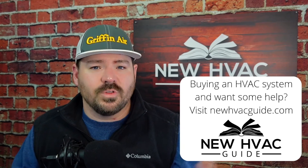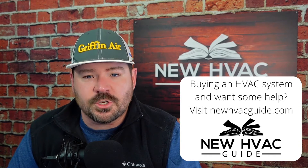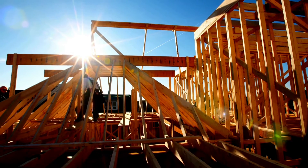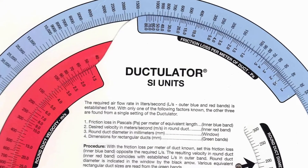If you already know who you're going to hire to do the equipment, I would recommend getting a couple of opinions on that ductwork. This leads into our next concern, which is pretty well known in our industry: the majority of ductwork out there in homes is not sized correctly. These homes were being built in the new construction phase, and for years guys were just slapping ductwork in — no one actually used a ductulator to make sure everything was balanced. A lot of these guys will argue that you can just put in dampers to balance everything, but that's not really a good solution compared to actually sizing and installing the ductwork properly.